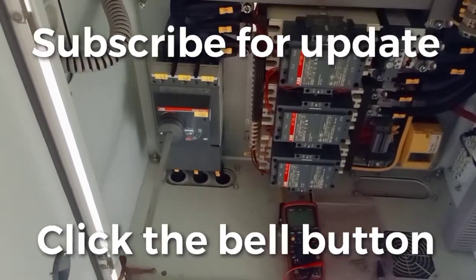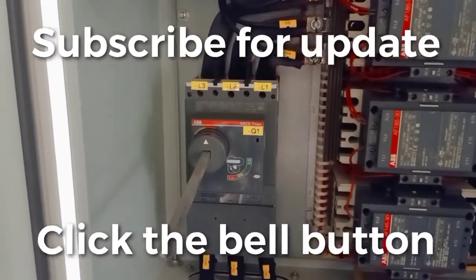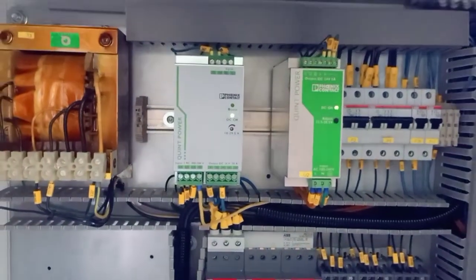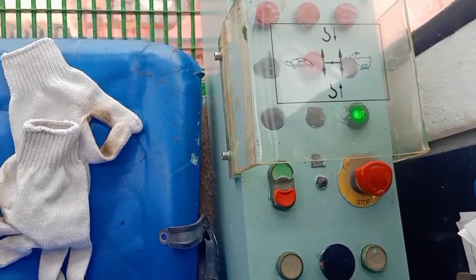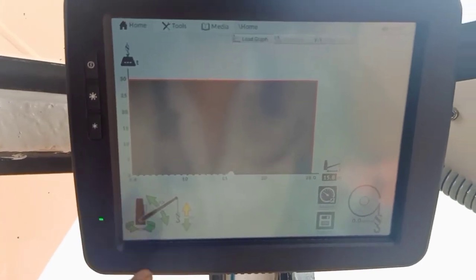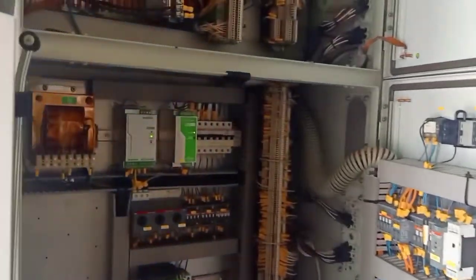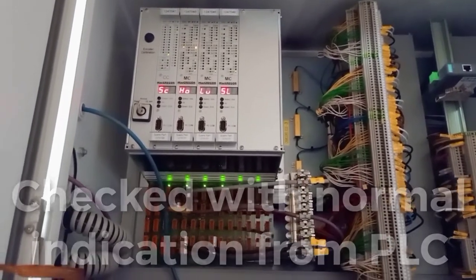Ready now to test — switch on this F3 breaker, and of course our main circuit breaker. So it's now inside, so we can see the circuit. As I observe, there is already indication on the PLC. We'll start the controller — start on the crane. From the monitor, it must be like this — this is the normal indication. That's our electric motor inside. That's the PLC — it's working normally now.